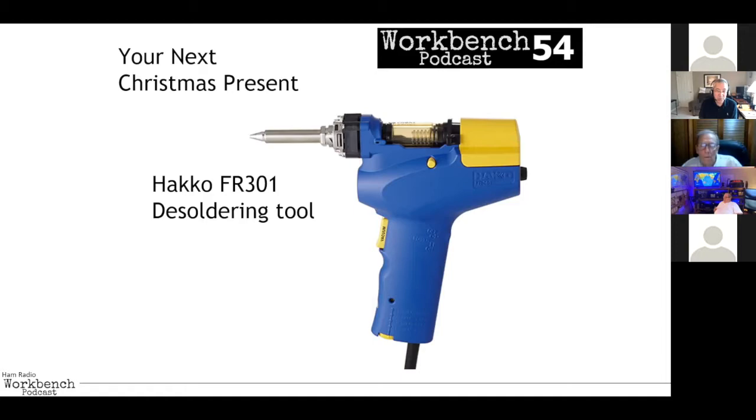Now, most of us grew up using these really chintzy $10 vacuum solder pumps or solder suckers where you push down the plunger, you hit the button, and it tries to wick up the solder. Those are terrible. They never work right. The next best thing is solder wick, where you heat up the joint with this braid, and through capillary action, the solder gets sucked up into the solder wick. The problem with that is you bake the living daylights out of your solder joint, and you have a good chance of damaging the board, the traces on the board.